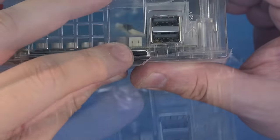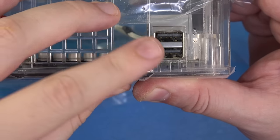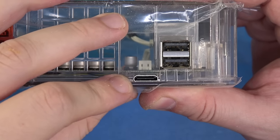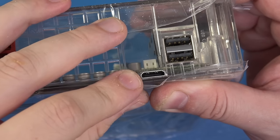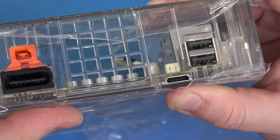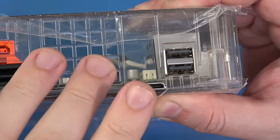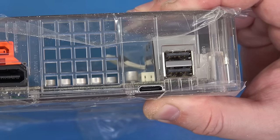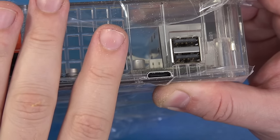That is a fantastic HDMI port. This looks fantastic — everything is relatively close and tight. Blow all the dust out, then get the main board affixed and mounted so we can do some testing before fully reassembling. Before testing, affix the heatsink — line up the provisions underneath, big pad to big provision, small pad to small provision. The only thing that must be connected for testing is the Wi-Fi card. The optical drive doesn't have to be connected. Plug in power and make sure digital video works.